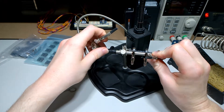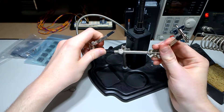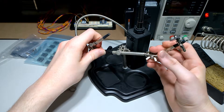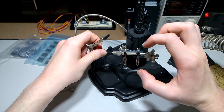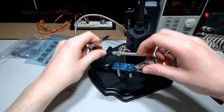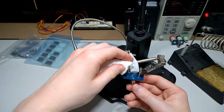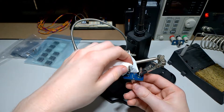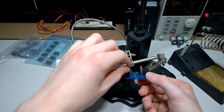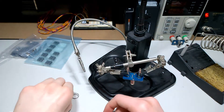Now just make sure that they're parallel, and that they're also in line. Could be a bit better, but that's probably good enough. They will flex ever so slightly when you put them into the plugs. Now for the USB connector, it's just a simple case of clicking it in. Make sure it's the right way around. And you'll hear a good click, and that will hold it in pretty well. You'll want to make sure it's nice and straight, and then you can solder it in.